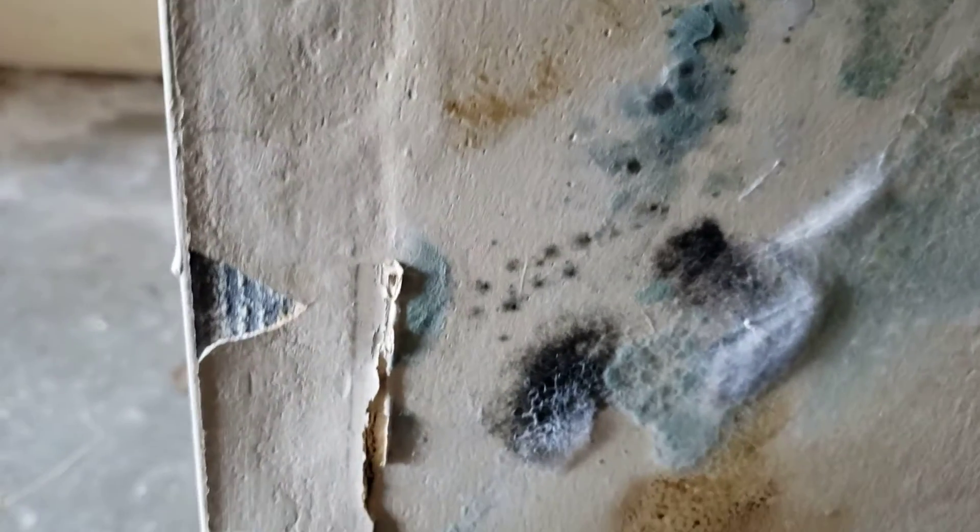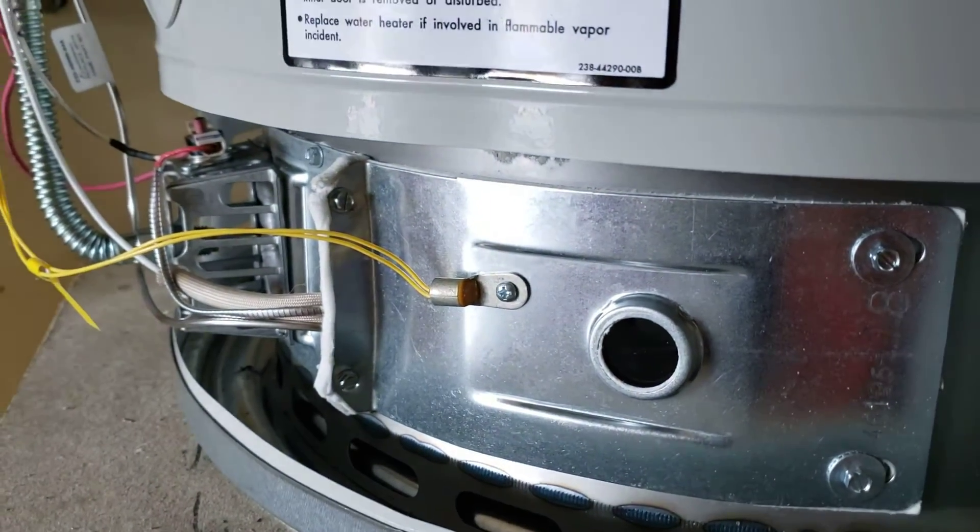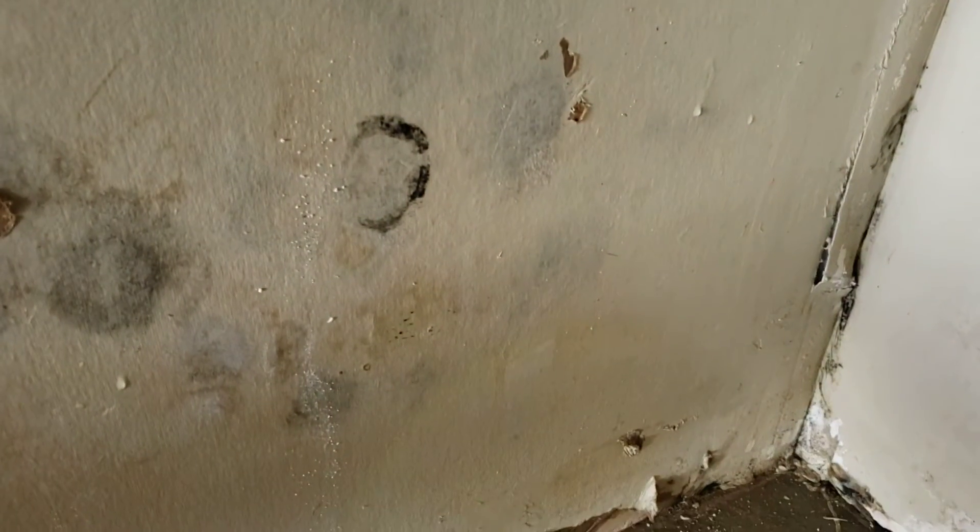We can only go on what we were told. This is probably half-inch sheetrock — you've got corner bead right there, the metal strip. Pop that sheetrock off. Don't ever blow a fan on this because that's where the gas and air goes into the unit, but you can point something down here if you feel there's water down there. Take that off, get everything dried off real good, and then just replace it with OSB board — nail or screw the corners and everything, and that'll keep the shear.